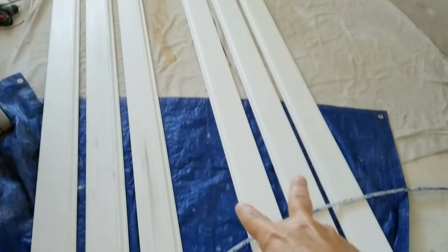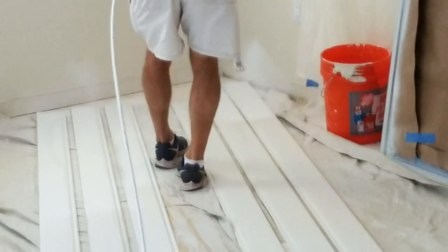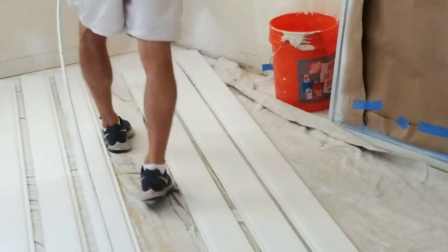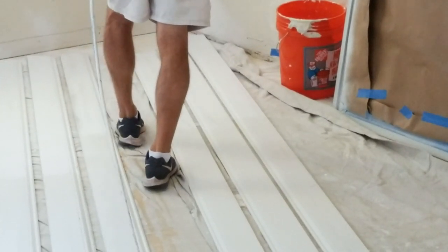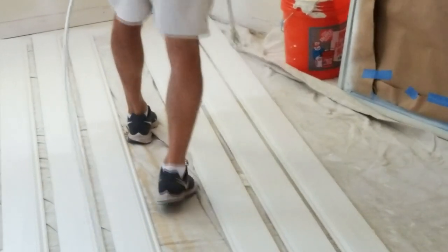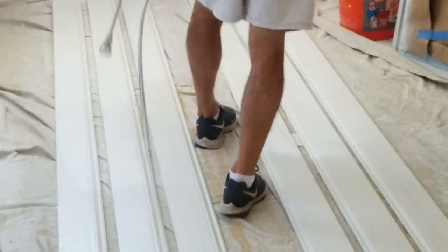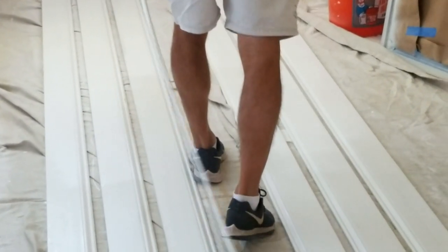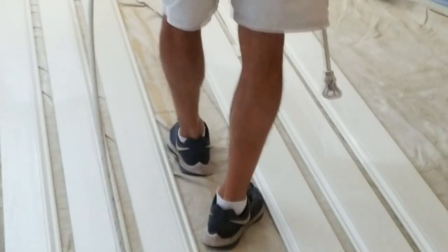While we're at it, we're going to be spray painting some baseboards here for the rest of the house. This is our preferred method of doing the baseboards — it's a lot more efficient to just lay them down on the floor and spray paint them all at once. It's a lot less time than painting with paintbrushes and rollers. And usually when you paint with rollers, you have to come back and do a second coat because the first coat's not enough.